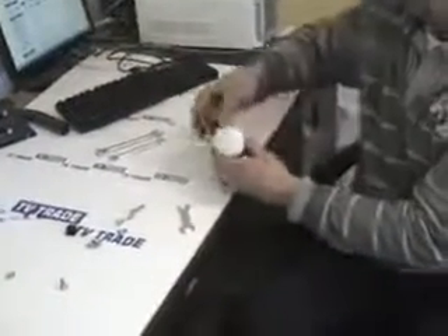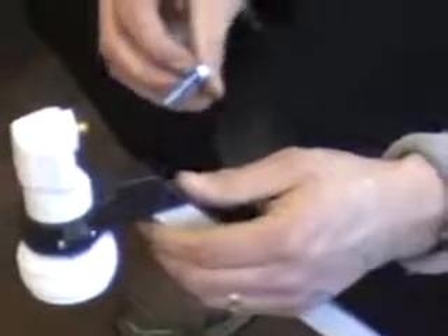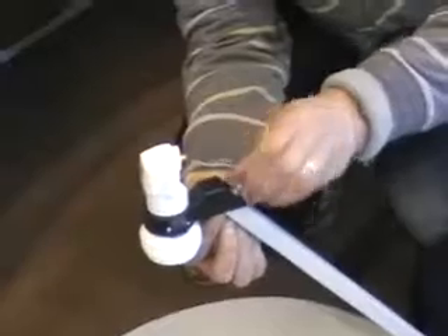We'll just stop here for a second. This LNB holder — we can slot it through like this and rotate the angle around. We simply have a nut which slots into a preformed hole here. If we push this in, this requires just a small Phillips screwdriver. We'll slot this straight through. The LNB will be slotted through here — see the hole here — we simply shove this nut through the hole and slot this in from the top. There's no particular significance to which side.